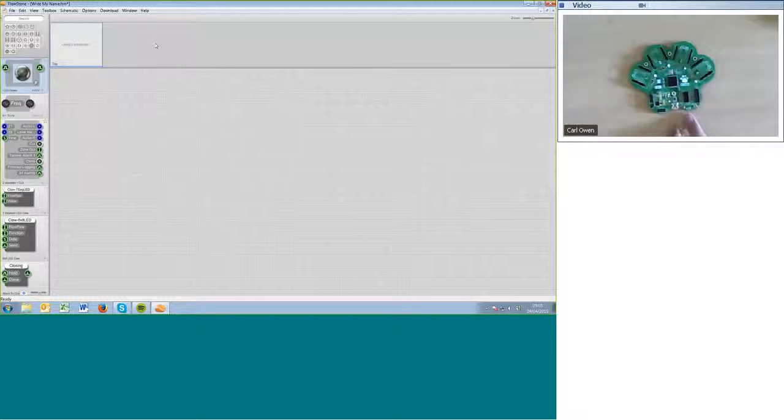There's also a little power connector here just for the servos. If you are connecting it to something that needs a bit more power, like a robot arm, you can just move this little yellow jumper across and use external power instead of internal power. On the left-hand side, we've got this 10-way header, which is 4 analog ins, which are 14-bit, and 4 digital ins, 1 and 0, so you can connect ancillary products. To help with that, there's also a power header with 5 volts and ground, and 3.3 volts on this header. There are also 4 LEDs and 4 little push buttons.